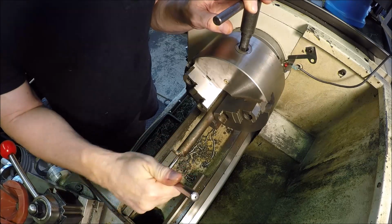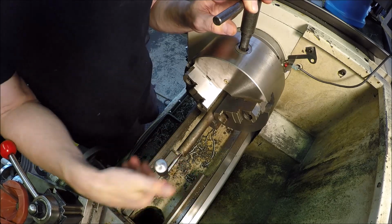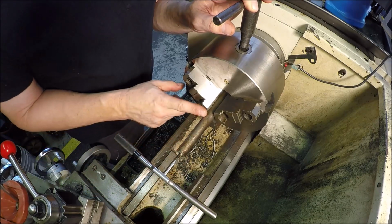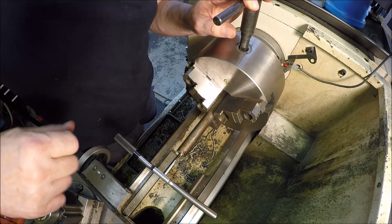Alrighty, you guys get the hang of it. Let me finish this up. I've got a bottoming tap I'll run in after I pull this taper tap out. And then all I'm going to do is move over 2 inches and 618 thou and part her off, and that'll be one. And then we've got to make 2 more.